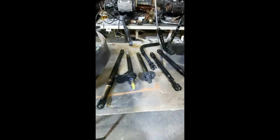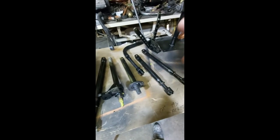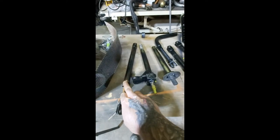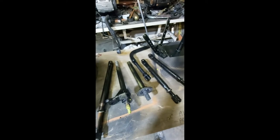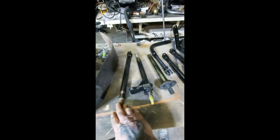I've started on the painting of the different components. I'm going to do the same as what I did originally — they were coated first with undersealer to give them a textured finish. Some have been coated with green over them, some with red or orange as you can see by the bit of overspray. Then they're coated with black again. I'll rub them all down tomorrow and then they will be lacquered to finish. These guys here will be cut later to be adjusted, so they'll be painted afterwards on the treaded parts.